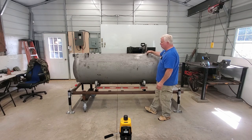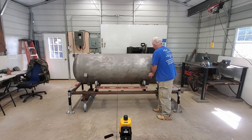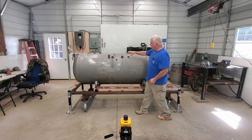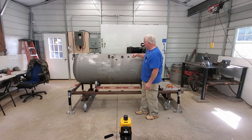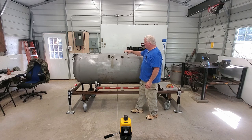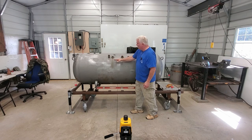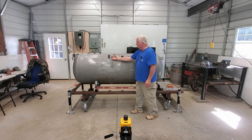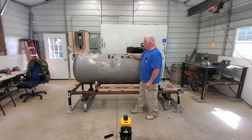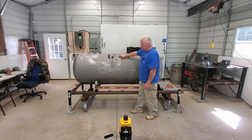These small welds here won't cause a problem for us. The next area that we want to stay away from is these bung holes. I'm fortunate in this case that there are only three of them to deal with. I'll just knock all that stuff off and grind it smooth. But this one particularly has a very large weld right there that could cause a problem if we get a corner of a door too close to it. It'll want to peel that door up a little bit because the weld is on this side — when the weld shrank, it wants to move the metal in that direction. So we'll just keep those as far away from the door as we can.